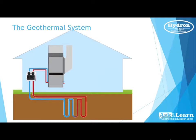Well, thank you, Kyle, and good evening to you folks out there tonight. Basically, what you can see on the screen is a geothermal unit, a package unit we'll call that, which means it's a self-contained unit. It'll have the compressor, the blower, possibly some electric resistance heat in there, and associated ductwork that ties to it. And then you'll see a pump, or a flow center is another term that we use, as well as associated loop field piping. In that illustration, it's representing a vertical loop field.